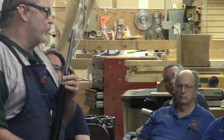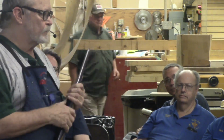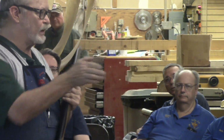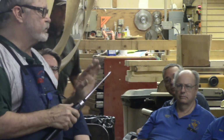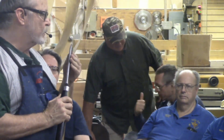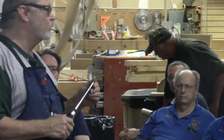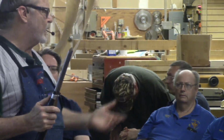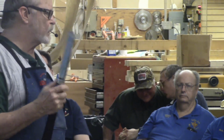Have you ever used a bandsaw or a chainsaw that's just a little bit dull? What's it like? Can you cut a straight line on a bandsaw? Superman can't hardly do it. No, the skew's the same way. It'll behave in direct proportion how sharp you get it. Okay, so we got to take it another level. This is just a starting point. Okay, true of my bowl gouges and everything too. I never use them off the grinder unless I'm roughing. I mean, there's a place for a rough grind, but if you want a tool for finer work, you're going to need to do more to it.